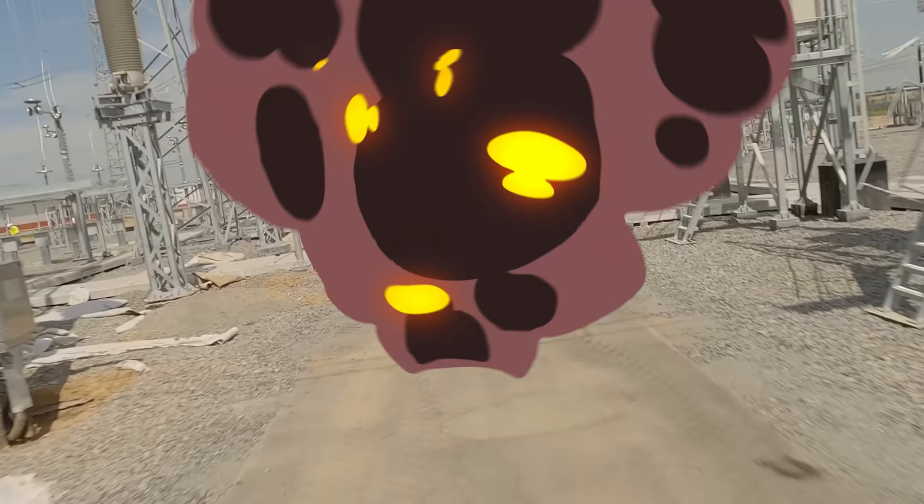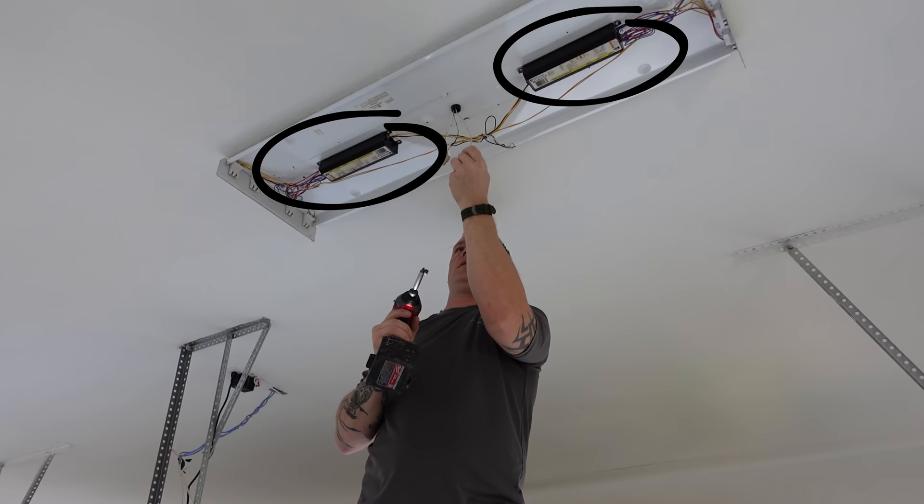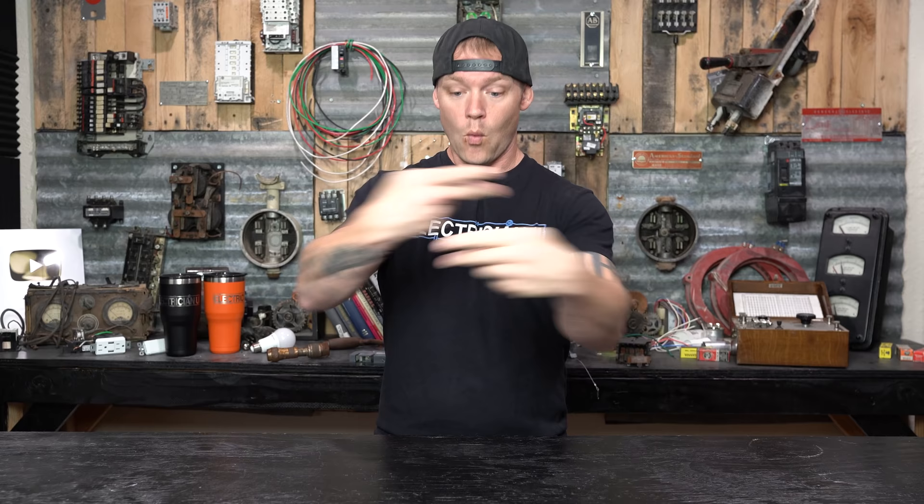Fun fact — did you know that LED lights do not use ballasts? They use drivers instead. The difference between a ballast and a driver: essentially they're the same thing, but a ballast just takes one voltage and changes it into a different voltage, whereas a driver also changes AC power to DC power. In these existing fixtures there are actually two ballasts. These are old magnetic ballasts. They probably just had a lot of two-lamp ballasts in the manufacturing process — it was probably cheaper than making a four-lamp ballast. You'll see a lot of older T12 fixtures done this way, wiring two two-lamp ballasts together on the tombstones to work as a total four-lamp solution.